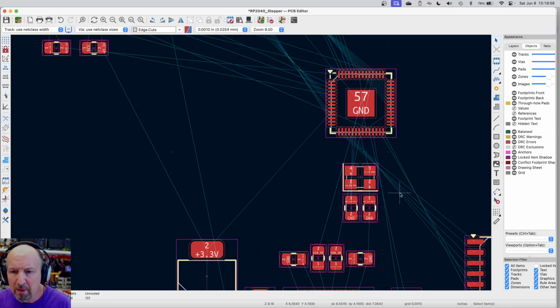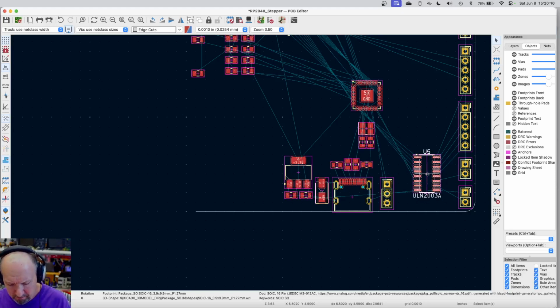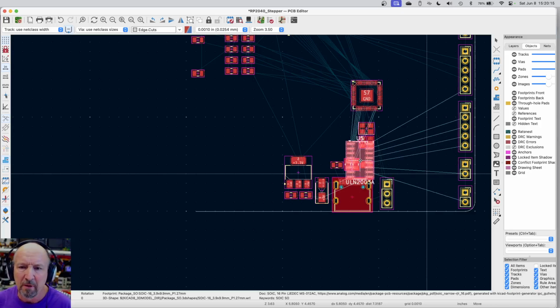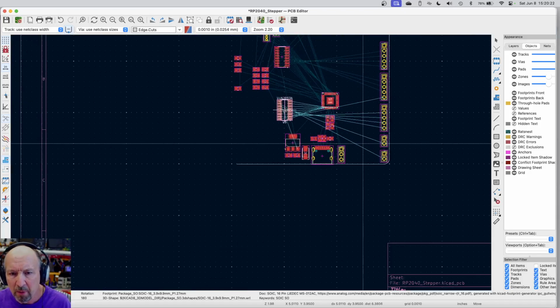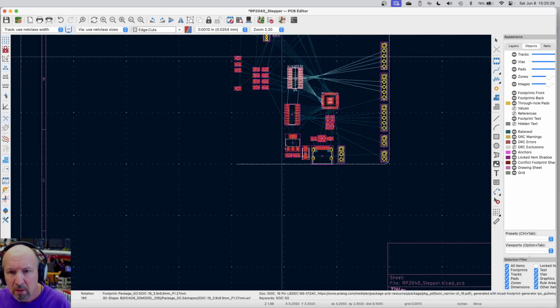So I could probably wire that okay without much problems. These traces come in, they go clear up onto the top side. We do have 2 sides of this board, so we can probably get those 2 through. This part, I'm looking where it's connected, and most of the pins are actually on the left. So I'm going to put it over here, and I'm actually going to flip it over again. And it'll end up going next to the other part, but we're just going to bring this down here. And again, this one we can move down really close also, since we moved everything else down.